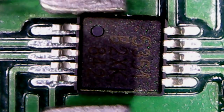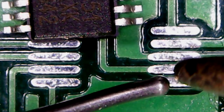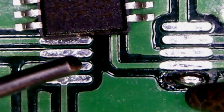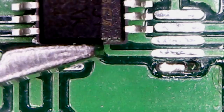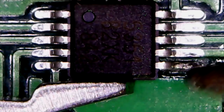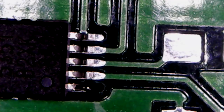What I have to do is align it as best I can and drop a tiny blob of solder on one pad first, just like with the resistors. It's actually easy to put too much — you can see that's what happens here, so I have to remove a bit with my soldering iron to avoid a short. There we go — that's pretty nice. I place the chip, solder that one pin, then solder the opposite pin on the other side so the chip stays aligned while I do the rest.